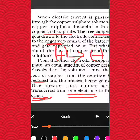So this process is electroplating. In this electroplating process, the negative electrode can be replaced by any metal. If you want to electroplate a silver ornament or a simple cheap metal and make it look like gold, then gold is kept at the positive electrode and silver is kept at the negative electrode, and you put it in a gold solution. On passing electric current, the gold from the solution collects on the silver, and some of the gold from the gold electrode dissolves and collects on the silver.